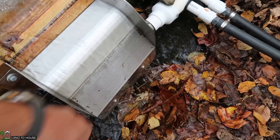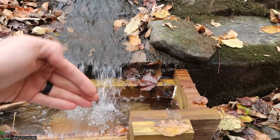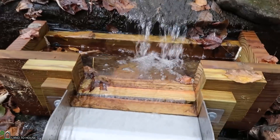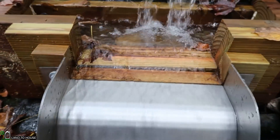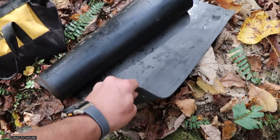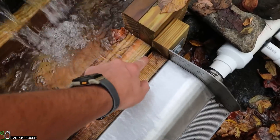It's not 100% efficient, but it definitely pulls a lot of water in. Here's the issue I'm having. Whenever I built this, my rock is slanted back, so my whole catchment box is just slanted down. And there's a little gap here where the water is going into this gap and falling out over here on the side. To remedy that, I have got some roof rubber — I think it's eighth inch roof rubber — and I'm just going to cut a square of that that will fit down in here. I can just screw that in and have the flap bridge this gap.